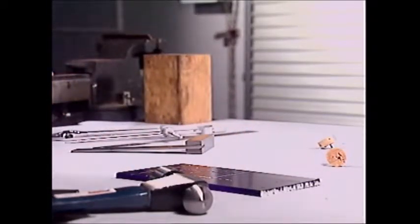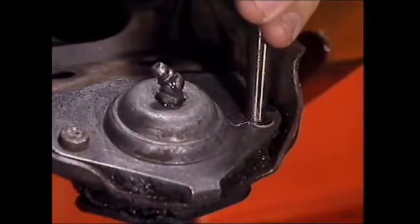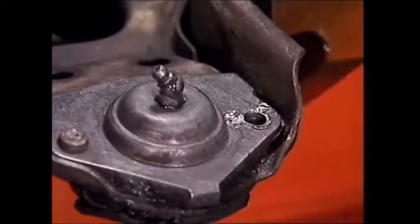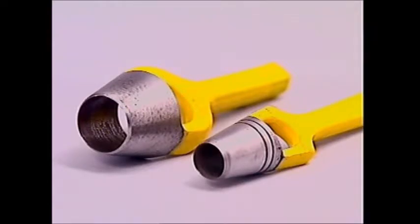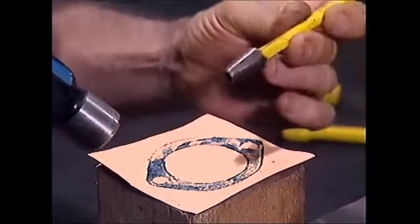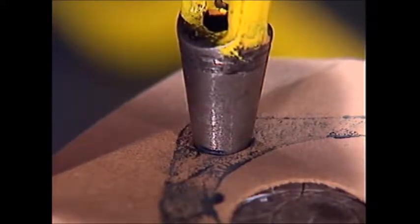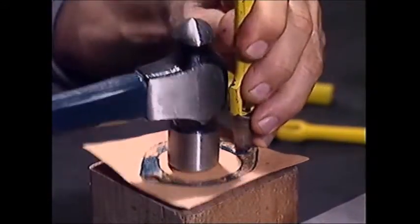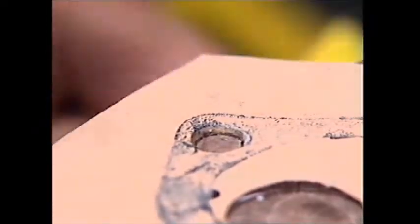It's easier now to draw the lines based on permanent marks. The pin punch is available in various diameters — it's used to drive out rivets or pins. Special punches with hollow ends are called wad punches or hollow punches. They're the neatest tool to make a hole in soft sheet material like shim steel, plastic, leather, or most commonly in a gasket. There should always be a soft surface under the work, ideally the end grain of a wooden block. If a hollow punch loses its sharpness or has nicks around its edge, it'll make a mess, not a hole.